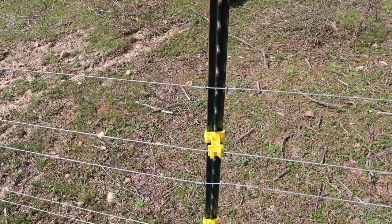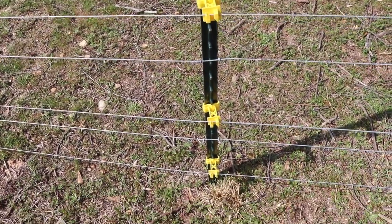One thing to keep in mind when going up and down hills — use more wood posts rather than metal T-posts. We had a couple of spots where the fence rose up as soon as we tightened the wires and it pulled the T-posts up out of the ground. This high tensile fence is so tight that even weighing those down with rocks didn't really work that well. As far as the voltage, we found that 8,000 volts was about what we needed for the fence charger to actually control the goats. It certainly makes it bite and makes them think twice about pushing through. Definitely keeps the dogs away — it's a pretty sharp bite for them. Supposedly that's good enough for cattle too, so we'll see when we get some cows up here.